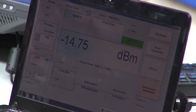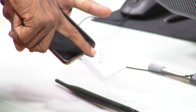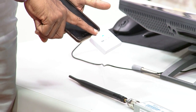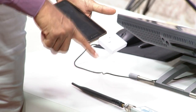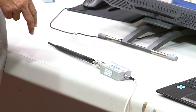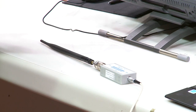For this I will take a nice paper and run through that paper so that we complete the understanding of the complete system. If you recall, we showed you the transmission with an RFID reader, and the RFID reader that we were using was this particular one. You can see this is an RFID reader. This is throwing power, transmitting at 25 plus 25 dBm, and we said that for any RF energy harvesting, it is not important what the transmission power is, but at what received power the harvesting actually starts off, what is the efficiency of the RF-DC conversion, what is the efficiency of DC-DC, what is the combined efficiency of DC-DC as well as RF-DC and so on.